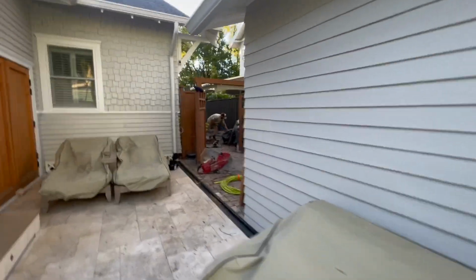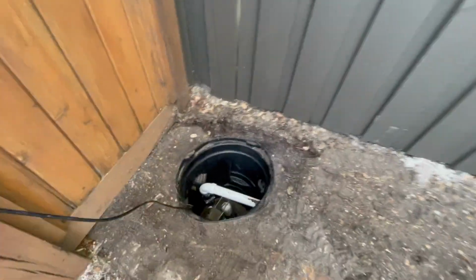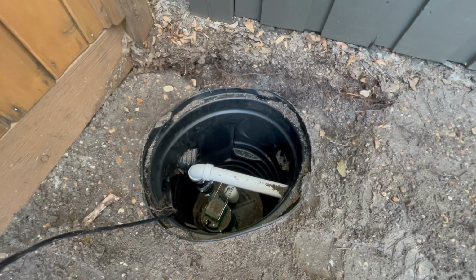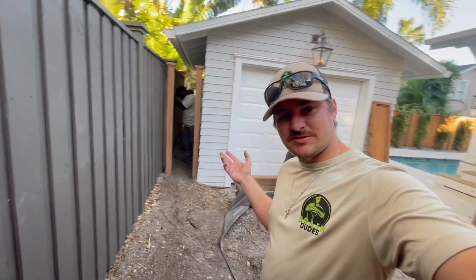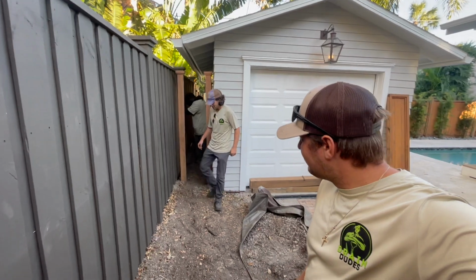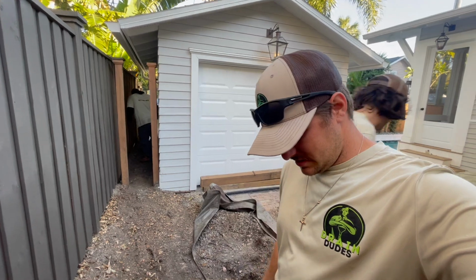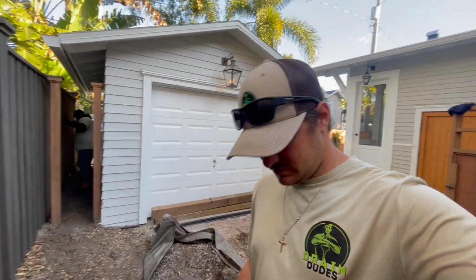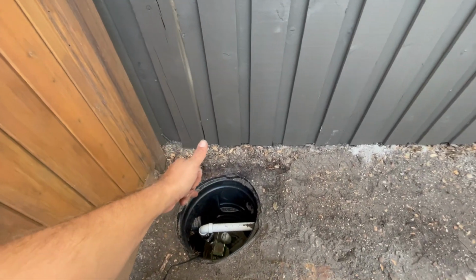So coming back here, we're just getting this cleaned up at the end. Got our sump pump in and plumbed. I totally did not video actually how to plumb the sump pump. That's my bad. I apologize. Brandon learned it. So I'll link the video where we taught Tristan how to do the sump pump, and you can learn it there. Super simple. Just a threaded bit to a riser, to a check valve, to a 90, and then out.